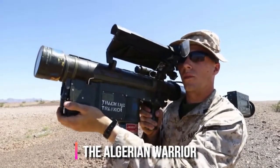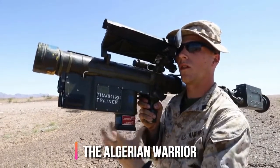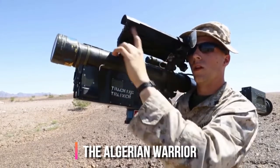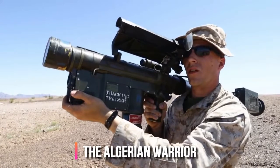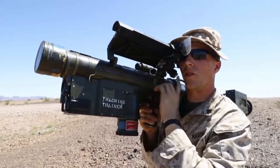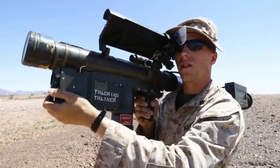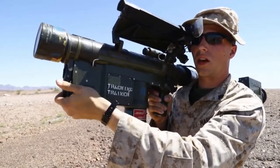You're going to sight in, you can see the aircraft coming. I'll quiet that down so you can hear. You're going to sight in on that aircraft. You're going to put your rear sight reticle, match it up with your range ring. You're going to put the aircraft straight into that range ring. So you're tracking the aircraft and you're going to hear the tones going. You'll be able to tell the difference between the tone of a tracked aircraft and if it's untracked. So once you hear that tone, you're going to press that uncage button.